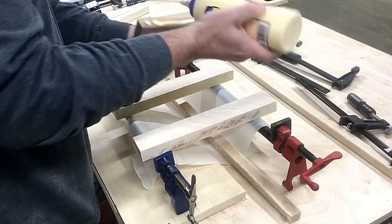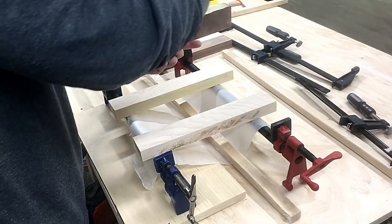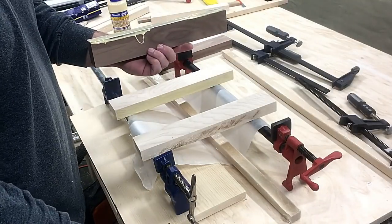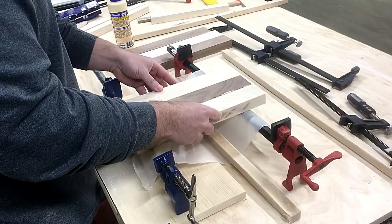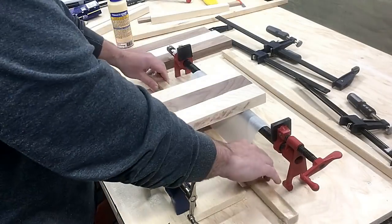The glue up was done with Titebond 2, since it's the only wood glue that I buy, but since these aren't going to get wet, you could really use any type of wood glue. Or you can use Titebond 2 and use these as a cutting board if you stop using them for beanbag toss, as long as you use a food safe finish.